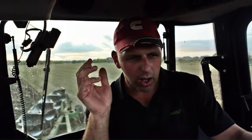Well, if I was to get one of those systems, which I really am considering, I wouldn't be able to put it on the front of the Fastrac, because at 1.3 ton, the 350 would overload the front axle. But the little 120, if she puts out plenty of air, she's only about 750 kilograms, so she would go on the front of the Fastrac. So it's going to open up the tractor mounted compressor market to a lot more people that haven't got the bigger tractors. So it's going to be really exciting to see that new bit of kit, and obviously see the manufacturing facility.